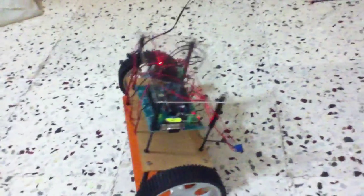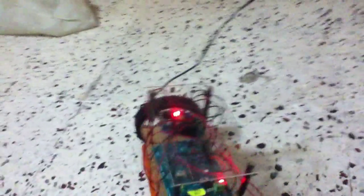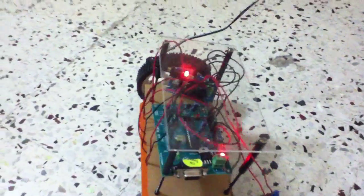To make sure this oscillation doesn't occur — even though the model is balanced, the microcontroller itself is creating its own error and then trying to rectify it. Creating an error and trying to rectify the same error causes the whole model to oscillate like this. That may cause the motor driver IC right here to burn out because of excessive current draw, so I'll try to make sure it goes in just one direction to avoid this oscillation.